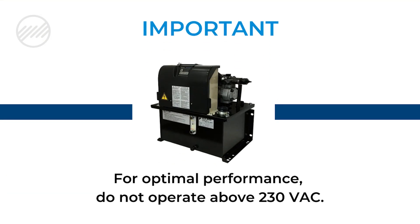The Daikin EHU has the ability to display several different alarms. If you see E15 flashing on your display, that's an indication you have an undercurrent or undervoltage to the unit. First thing we want to check is that we're within our voltage range — ideally between 200 and 220 volts AC. You can be plus or minus 10%, but you really need to stay within those parameters.